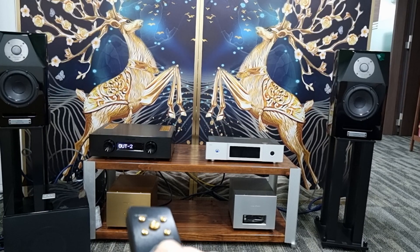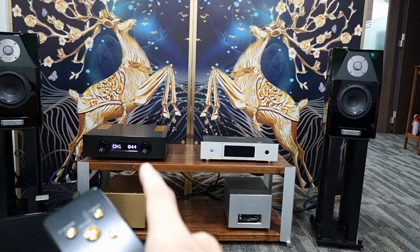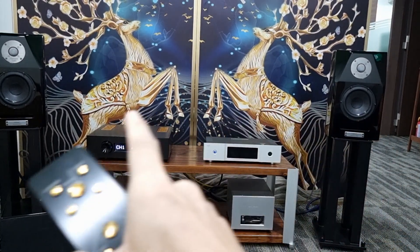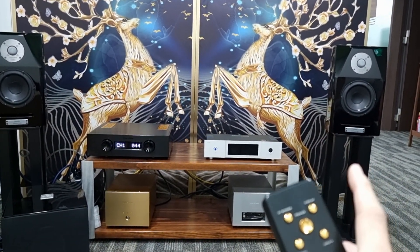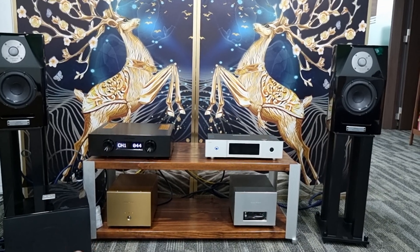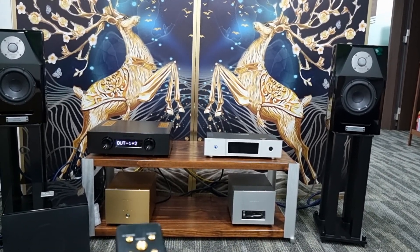With output 2 only selected, the integrated amplifier's built-in section is bypassed and only the preamp output is sent to the EXB7, which drives the woofer of the bookshelf loudspeaker. At this point we are missing the high frequencies from the tweeter and also the REL subwoofer's sub-bass, because the internal amplifier on the EX-M1 Plus is bypassed. So the correct mode to use is output 1 plus 2.